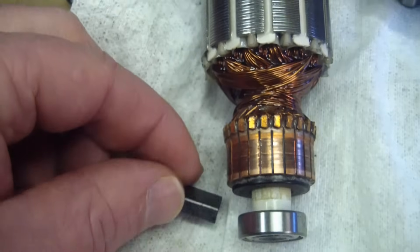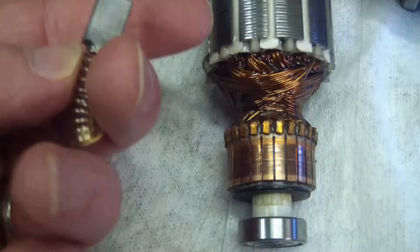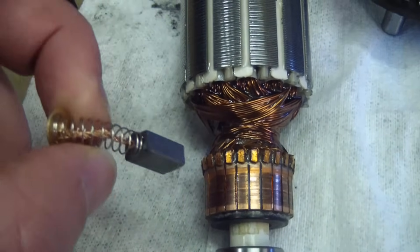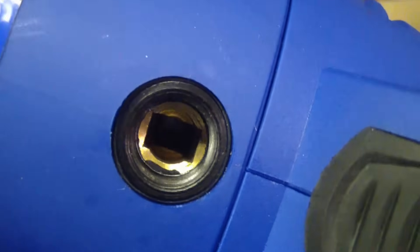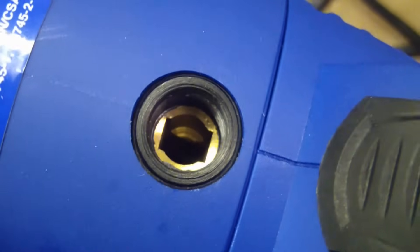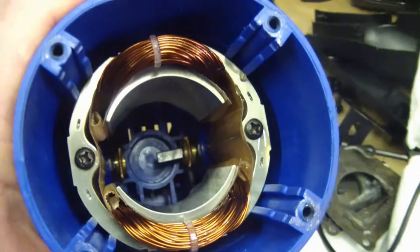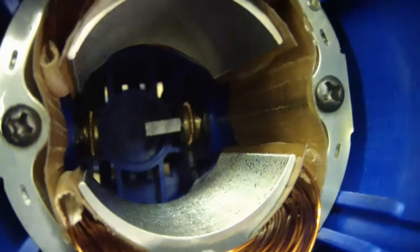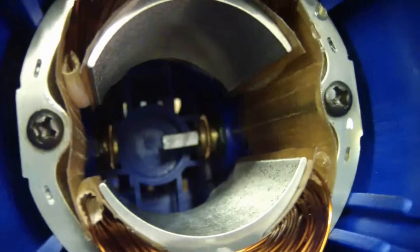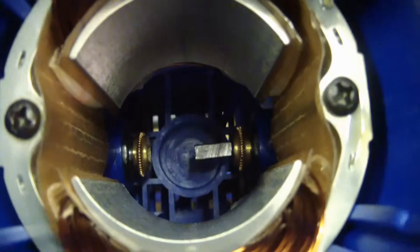Here's one of the brushes — just a little wee guy running 6 amps, no porosity, nothing wrong with that, looks like it's connected well. Here's the brush holder — nothing wrong with that, nice heavy brass section, well machined, nicely broached. The field windings — nothing wrong with that, very nice. Located by two fasteners and very nicely connected with heat shrink and nice big brass posts.